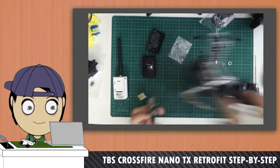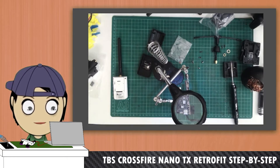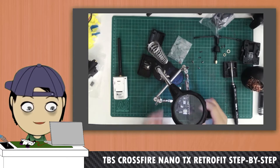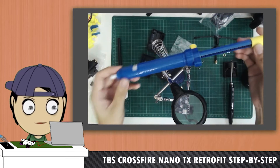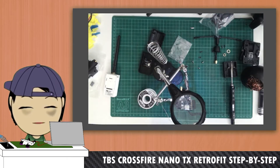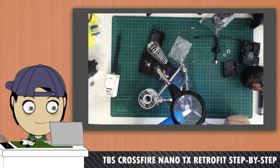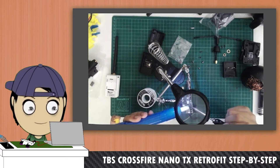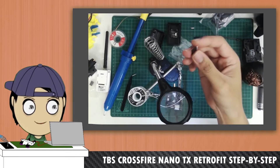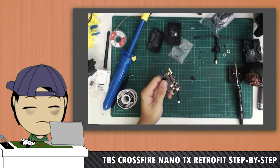So let me get my soldering iron and we'll get this out of the way. Now while doing this procedure, I want my soldering iron to spend as little time as possible on this, because as you can see, this part is basically plastic. And the best way to do that is definitely with one of these desoldering tools — it's basically a suction that I pump, and it sucks out the air when I press this button. The objective of this is to introduce new solder to flow down, make sure it enters a liquid state, then press the suction. Put my soldering iron there, melt it and extract. Suck. This is now ready to be placed into the retrofit kit.